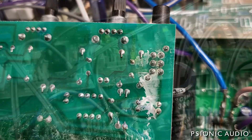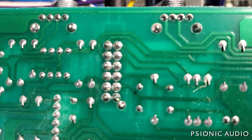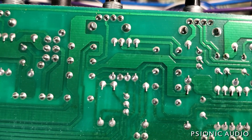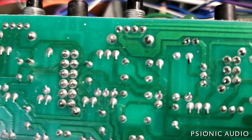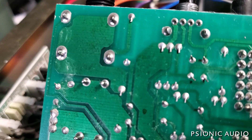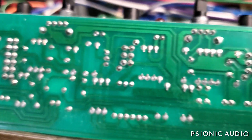Anyway, enough of that. Now I've got to do similar work on the preamp board before I put it all back together. The preamp board has more of that lovely spill substance, some broken solder joints. I see a lot of solder joints that need a little extra attention. The pots need to be cleaned as well. There's some heat discoloration in one area — there may just be discoloration from components on the other side showing through. The input jack has some solder joints that are breaking. There's a lot more to this than just swapping out the board.